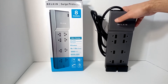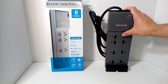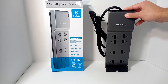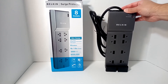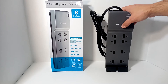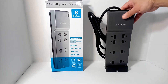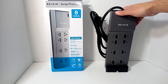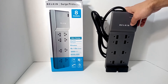One misconception is that these protectors will protect you from lightning strikes. You see reviews with people showing their fried surge protectors claiming it didn't work — but there are no surge protectors that are going to stop a lightning strike. The only way to stop that is to put a surge protector on the whole house, right at the box where your electricity comes in, or between that and the meter from your electric company. Surge protectors will protect you from everything that occurs inside the house, and potentially from utility company surges, like if a transformer blows or electricity is restored after an outage.